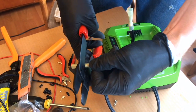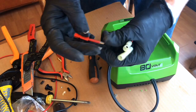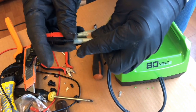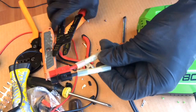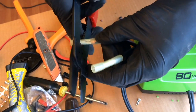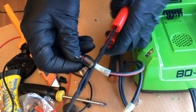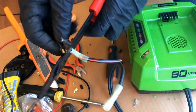I'm crimping on some 10 to 12-gauge wire and putting these Anderson connectors on the end — it takes like two seconds. I've had really good luck with crimp connectors for high-voltage e-bike applications. Soldering is great but time-consuming, and it can be problematic if you're not good at it. Crimping is just quick, dirty, easy, and fast, and it works surprisingly well. I usually just crimp it twice instead of once.